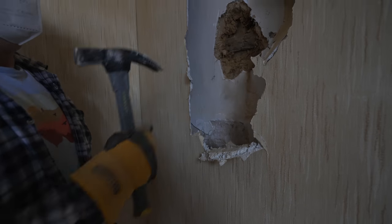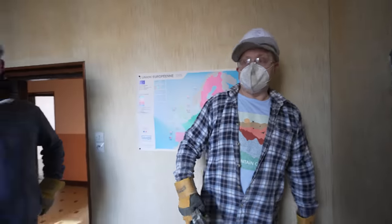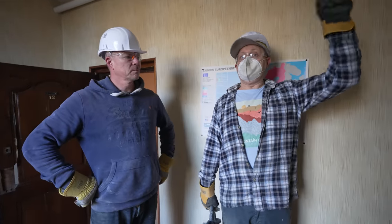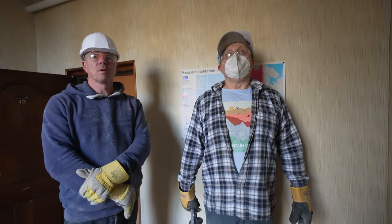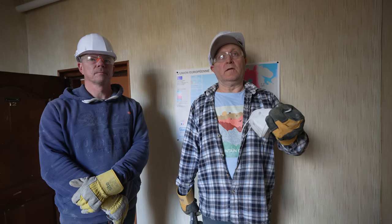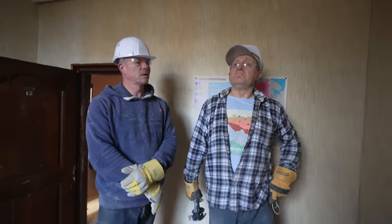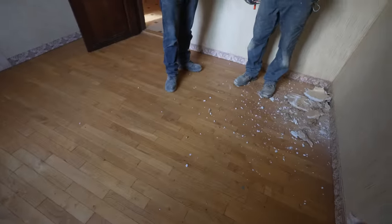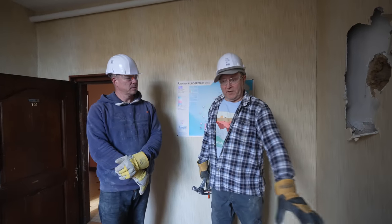Timber with clay straw infill. So, good news, it's not a load-bearing wall. Nothing above this. Above this is when it goes into the mansard roof design, which is essentially spread out over the exterior walls, but there's a few down beams. Yeah, it spreads the weight. So there can't be much weight up here. It's just a modern floor, and below this is going to be the original floor. So just floating a new floor over the top.